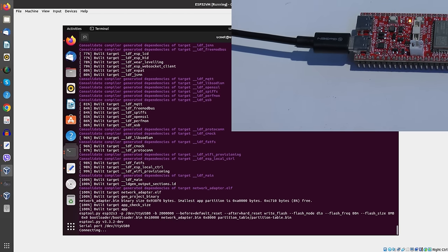Now we see it starts to flash the first partition. This is important — this is only the first partition. There are a group of different partitions needed to get Linux working on the ESP32. Sometimes it gets stuck here, and if it gets stuck we check for any errors about missing Python modules — we don't find any such errors, just the usual communication errors. At this point we have deployed the first bootloader, but the system is stuck. We try pushing reset but we won't get anything, so we put it back into bootloader mode.